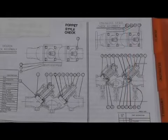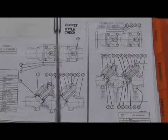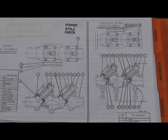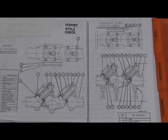So in the D2 series, again 3/4 through 1.5 inches, the poppet style check that we discussed could have the Delrin check disc holders or the stainless steel disc holders. Both were produced over the years, and the valve could have either one of those versions in there. There was one Model D series that utilized the 308-1 check in the small sizes, meaning 3/4 through 1.5 inches, which we'll show you as a footnote.